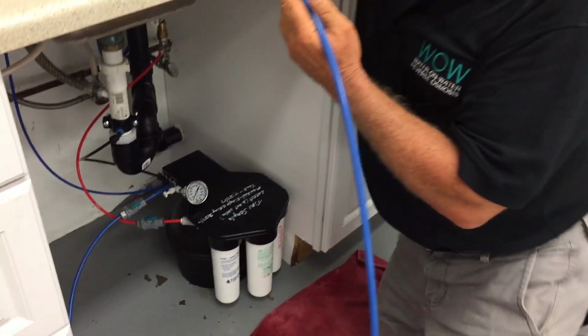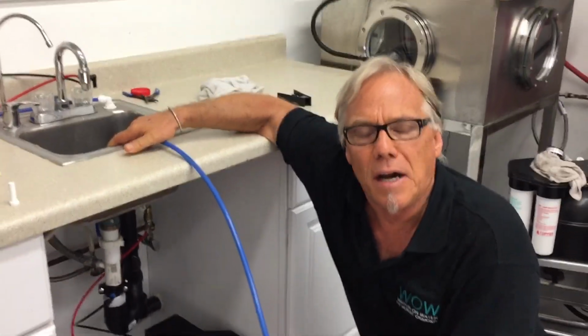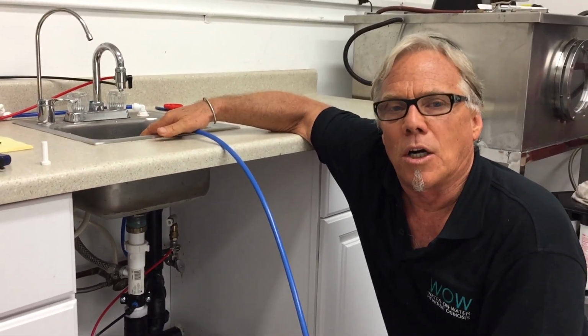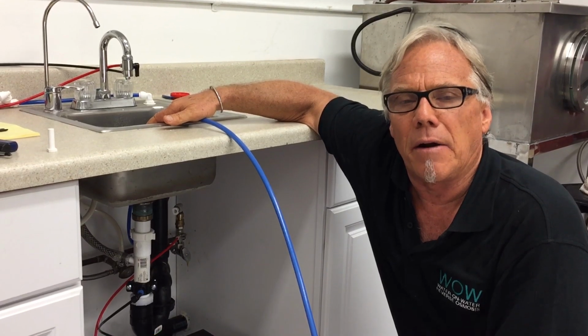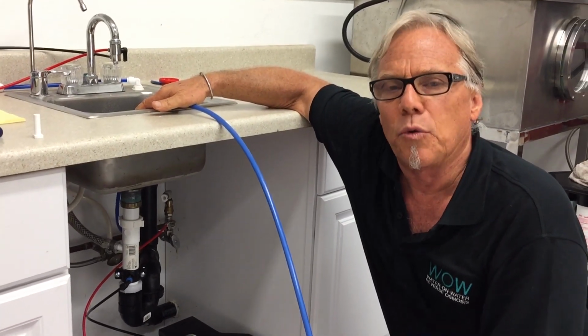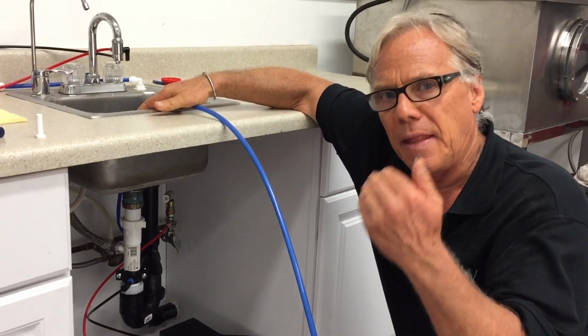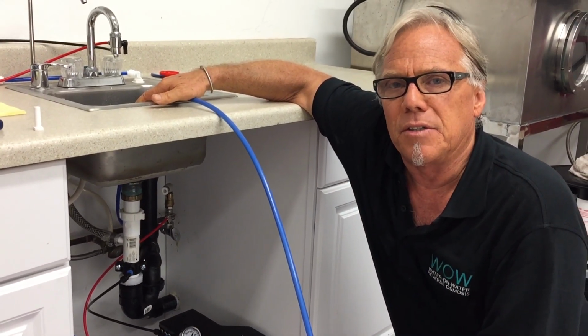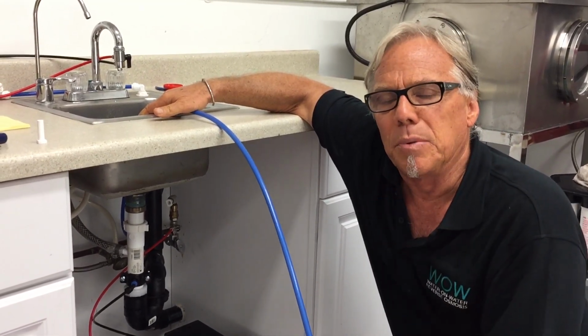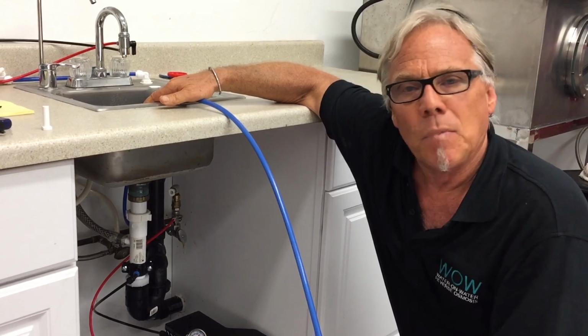When you install a second or a third or a fourth outlet, you must draw water across those lines and clear the air out of the lines. It will not work without it. So you have to go through a bleeding process. That is at the back end of each of these add-ons in the manual, where the final thing to do is to bleed the lines. Air trap, it will not work.